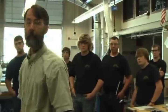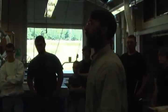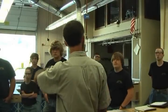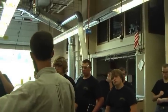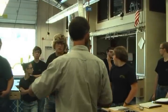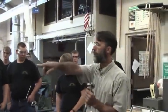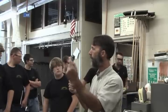It's difficult. Can you explain to them how you can dress a wheel for different, like, radiuses and stuff, too? Yeah. If you want a curved wheel, we've got the edge square for doing the chisels we're talking about. If you have need to shape the edge of a wheel, you can do that. We could roughly do that with this by rounding it off. There is another way to dress wheels. They have industrial diamonds like my grindstones, my lapping stones, where they have a handle something like this and a very small tip on it with an industrial diamond. And they use those to shape wheels to custom shapes.